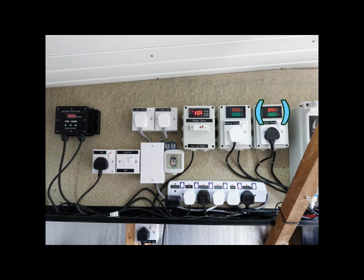This is monitoring the main airlift air pump — an 80-litres-per-minute air pump. It shows the voltage and it shows the current. The current meter in this little device is terribly inaccurate, so ignore the actual values. But what I know is that when it's working properly it's between 0.4 and 0.6 amps, so if it was to change from that, I know something needs to be investigated.